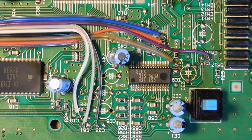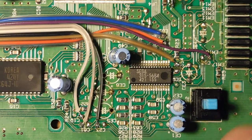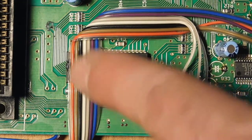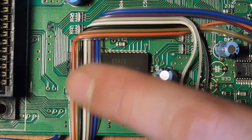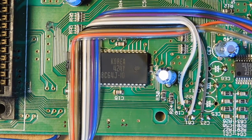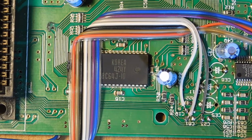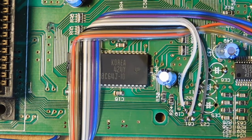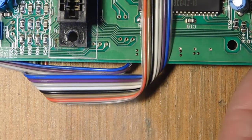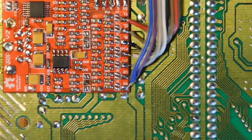So that gives you all of the audio sources on the Sega Genesis, and then they all get mixed in properly on the triple bypass board. And just to show you the wiring, the way that it works is I have it bending over this chip, and I did use a little dab of hot glue on top of the chip only, and this was just to secure everything in place and minimize the strain on those solder points, because it's a lot of cables, and that just helps to offset the strain. And of course, if one ever needed to, this could easily be removed with just a little bit of alcohol. And so then, at that point, the cables flip over, and they come all the way up here to the triple bypass board. So I think we're basically all set now.